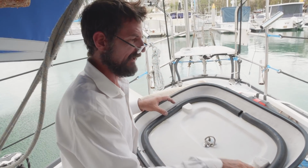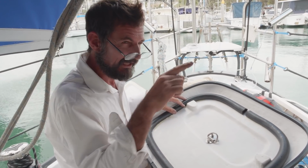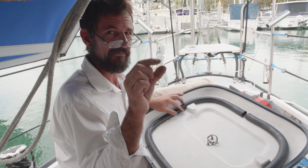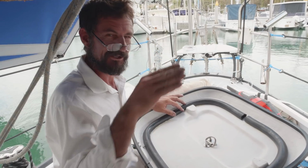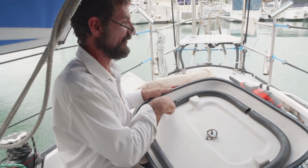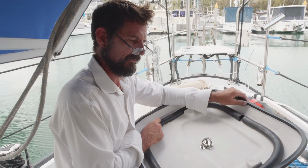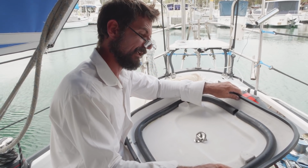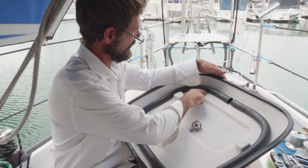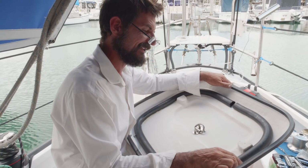Inside the hatch, this rubber seal that you see is pretty big, and the reason is there are gaps around the uneven size of the coaming of this old boat, up to like 3 millimeters of difference. It's not all uniform, and it follows the shape of the boat too. So we've had to go pretty high with a D profile seal on here, and the adhesive didn't really work that great, even though we got it from a reputable place. It wasn't bargain basement junk, but the adhesive hasn't really worked out, so I had to use a little bit of polyurethane Gorilla Glue on there, which is messy stuff, but it has stuck it down.